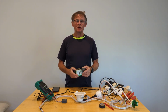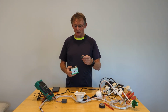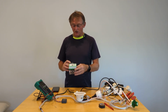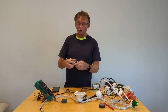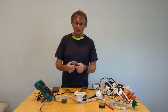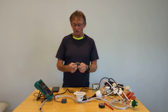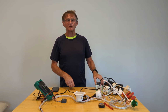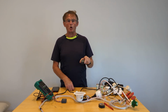Okay, so now that we've seen the gate in action and we've seen the possibility of opening and closing the roller door with a micro switch, let's look at what you get and how you do it. So this is a switch, it's called a micro module switch. It comes in this box and it looks like this. It has a looping terminal, which I would just not use. It has an input terminal, which you apply 240 volts AC to, a neutral terminal, an active terminal, and then there are the relay output terminals, which are normally open. Two relay output terminals. For those that don't know what normally open means, that means if the relay is in the de-energized state, the contact will be open.